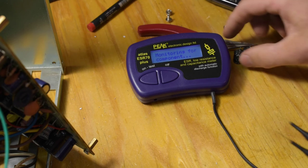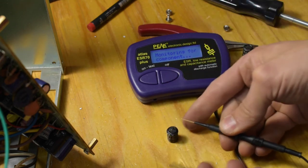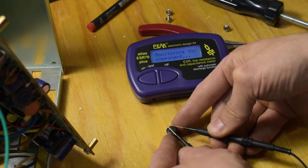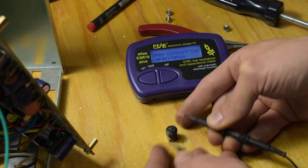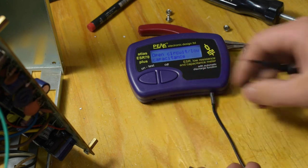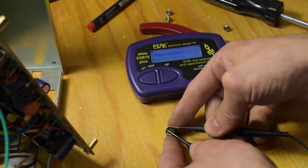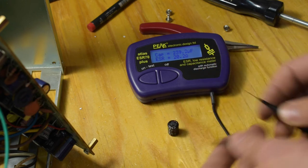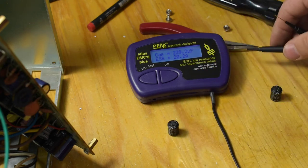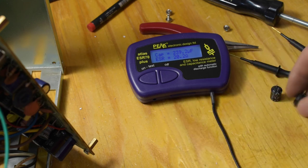I think I found a winner. That's the capacitor that's in series with the deflection coil. That's the one from the first monitor that I fixed — it doesn't even register on this — and that's the one I just removed. ESR is through the roof and capacitance is about half of the rated value. So I'll go and get the new one and throw that in and see if it helps.